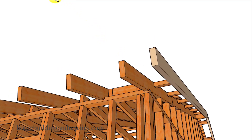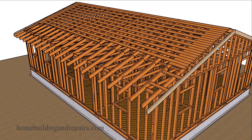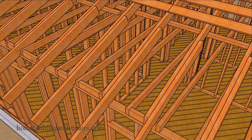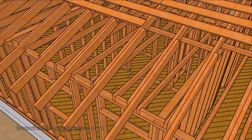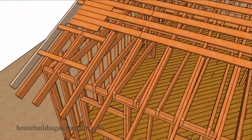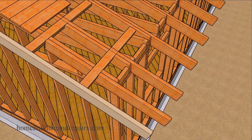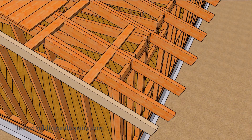Let's pan out and take a look at the roof overhang rafters along with how they will have worked out by nailing them to our existing rafters. You can see here where we had to remove this block but we didn't have to remove this one or this one. That's going to change a little bit further down because some of the rafters were moved over so that the ceiling joist would work for one of the walls as ceiling backing boards to support the drywall or interior lath and plaster.